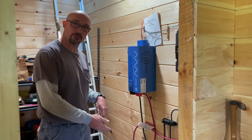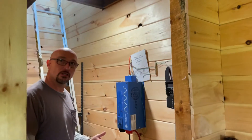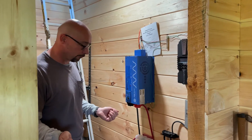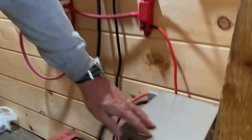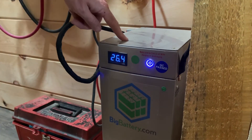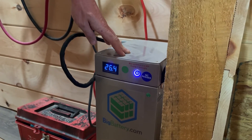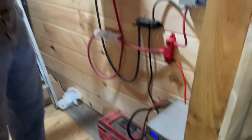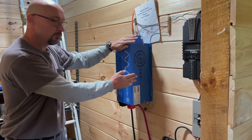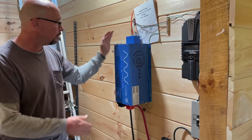So I just want to walk you through our power system that we have going right now. It's up and we have lights so we can see what we're doing and we can work in here. At night time we can turn the lights on and see — it's almost like normal. We're running on this 4.3 kilowatt hour battery right now from BigBattery.com. This right here is supplying our house with power right now. It's holding good. This is our power inverter that changes the DC power into usable AC power for us. So all of our normal appliances work — a normal refrigerator, a coffee maker, our normal lights.